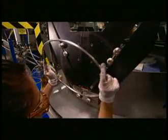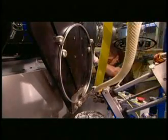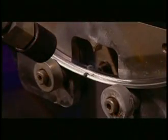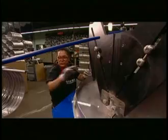The hoop must now be soldered together. An operator loads each hoop onto a rotating soldering jig, placing the ends together. A bead of silver solder is deposited on the joint. Then, natural gas torches melt the solder, fusing the hoop closed. Next, water cools the solder and the jig ejects the finished hoop.